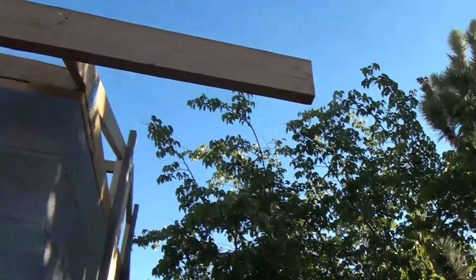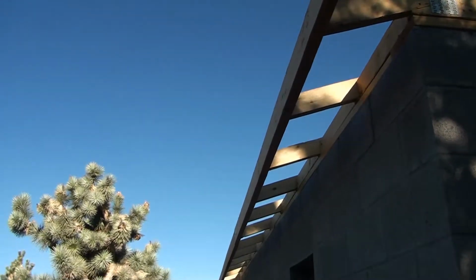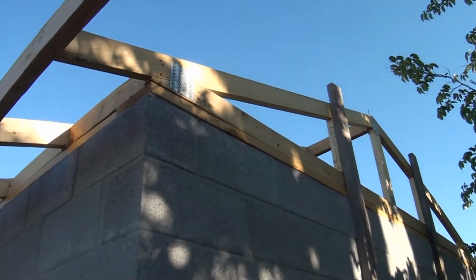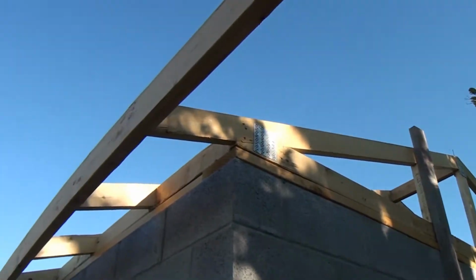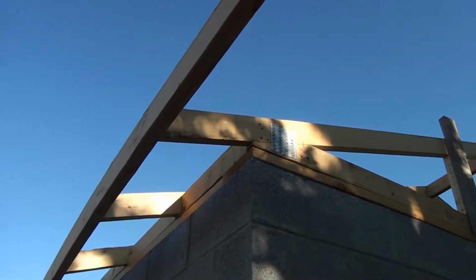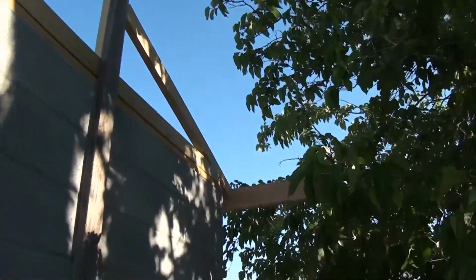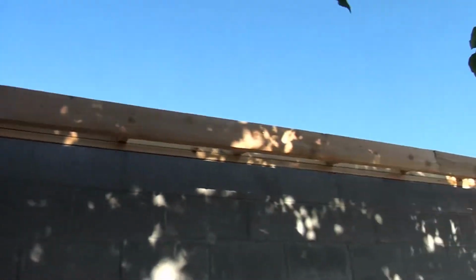And I tried to put that bow or cup facing in, and at the time I put this one up, the other end of it looked fine. Of course, you get them up and then they dry out more. I'm going to fix that. I'm going to build ladders next. It'll come off the end of the truss here, and I'll either go over the outside so this won't show as bad, or I'll maybe shim it underneath and try and pull it up as much as I can, make it look better. I'm really kind of disappointed with the way that came out, but the main thing is 99% of it, in my opinion, came out pretty good.